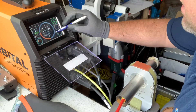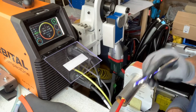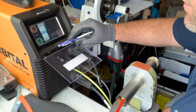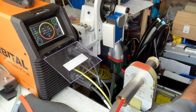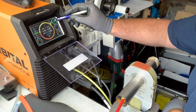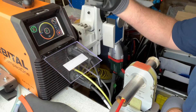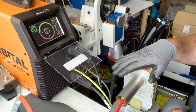I think the last weld was a little bit too hot in the last level. So on the I-current we can reduce all the amps down — I'm going to go to 95%, reducing the heat by 5%. That will calculate and then we're good to go. So we've adjusted the amps for the whole program, loaded them down. Press down again and we're back to the pre-purge. It'll now strike an arc with a short start delay to get the heat into the weld, then start welding. We'll see how this one compares at minus 5%.